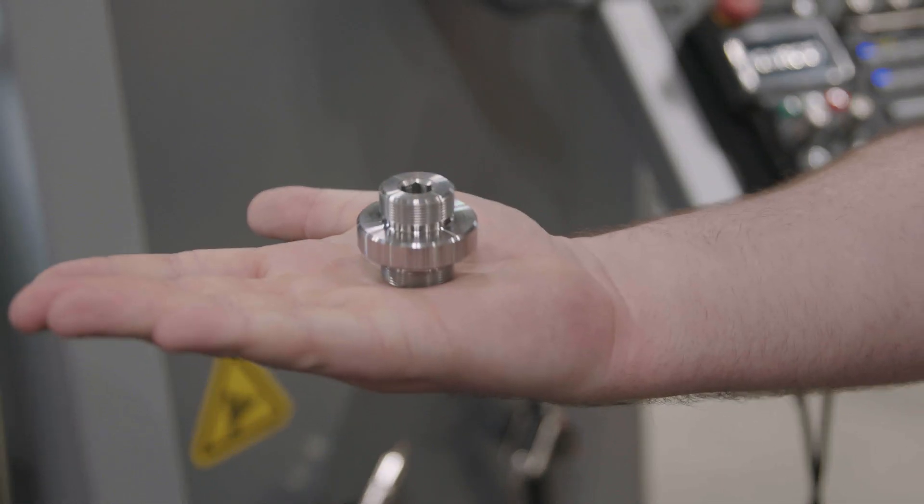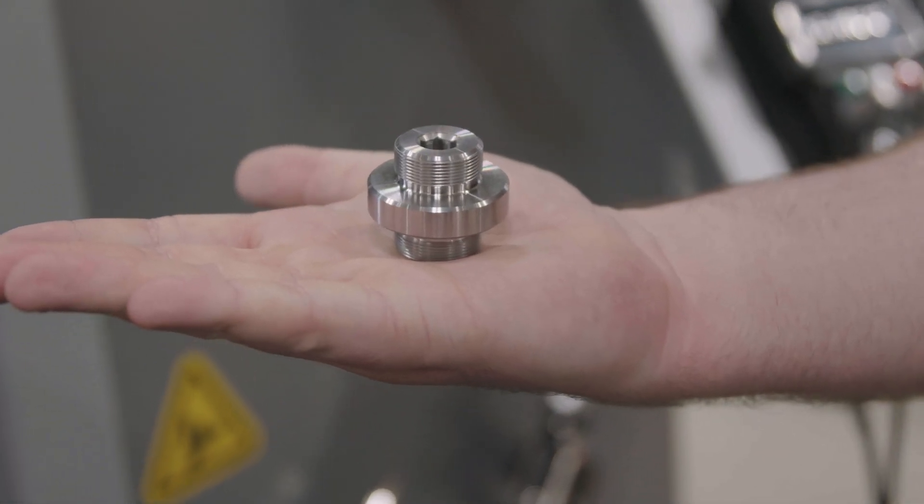A great example is one I've got just here — a relatively straightforward part. Just talk me through it very briefly. Ideally, a small component like this on a TM6 could typically take you 10 to 15 minutes to program, maybe. Produce the part in another 10 minutes, so if you were doing a 10-off, you could quite possibly have them out by dinnertime. Nice and simple.